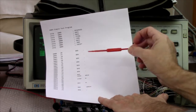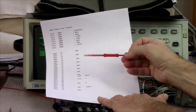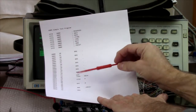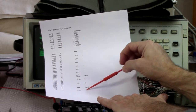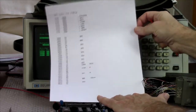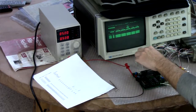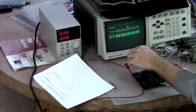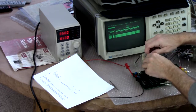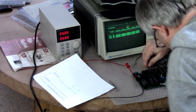There is no halt instruction on the 6809, which kind of surprised me, because I thought every processor had a halt or halt and catch fire instruction. But this one doesn't, so it just branches to itself. Okay. So as I said, I want to hook up the ROM and RAM addresses.